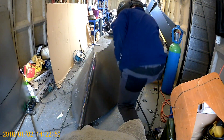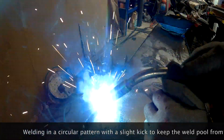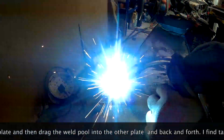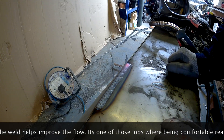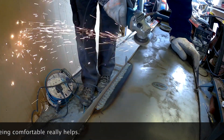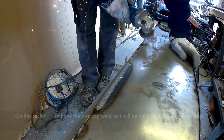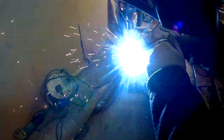I've never really had any leaks at all. What I do to make sure I never have any is I put a nice root weld in, then grind back into it a little bit, then put my cap over the top and try to stagger the joints. If I've done a root that's about 6 inches long, I try to start the cap halfway along so there's no joint in the same place in both the root and cap — it makes a really nice homogeneous weld line. At the start of a weld the heat is building and not penetrating deep into the steel, so I like to grind into the start and end of the previous weld before starting the next one, to ensure good penetration into a solid base. I'll typically top and tail each weld and run a little groove back into it.